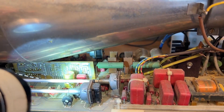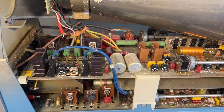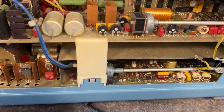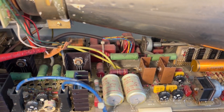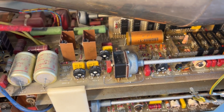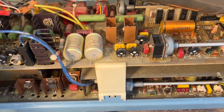A little circuit board here — probably some trigger and switching. Oh, look at that — one of them was replaced. Here is one of the deflection amplifiers. If we follow the signals, that will of course be from the input amplifier, and all this is deflection amplification. Look at that — the other deflection is here. Those resistors and those transistors — that's the other. I bet this is the time base, and this is the vertical amplifier.